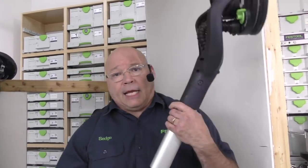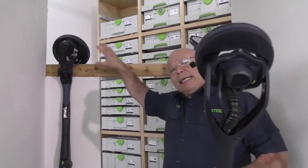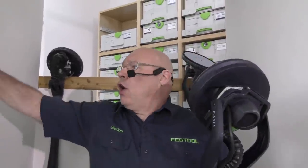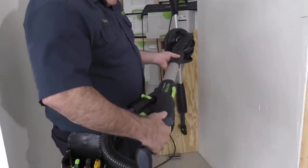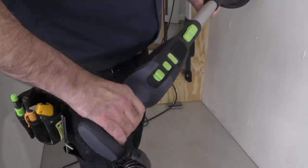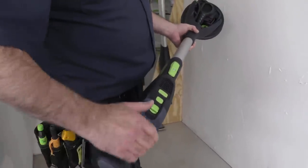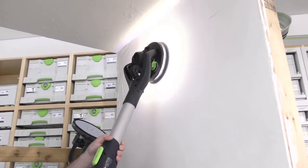Now, as I get going with this, I used to coach everybody, with the Classic and the EZ, you always would start it on the wall, the pad on the wall, and then start sanding, and then remove it and turn it off. With the random orbit action here, you always start it off the wall. So, let me get going. There's an on-off switch. I always start between 5 and 4 to get used to the machine's speed. Oh, that's the pad speed. This is your on and off. I'm going to turn it on. And you're going to see...